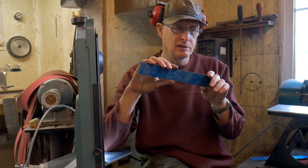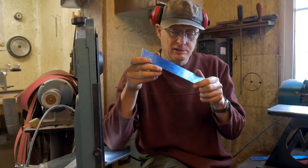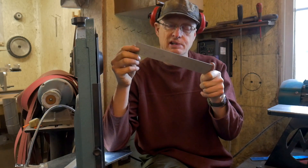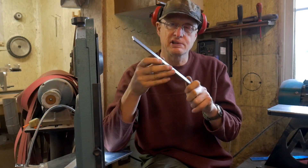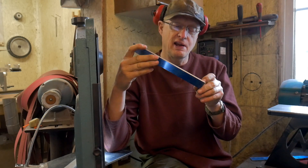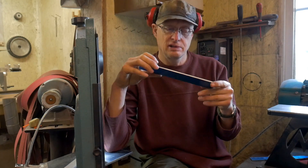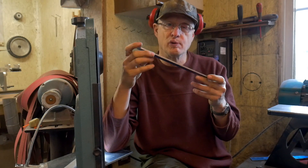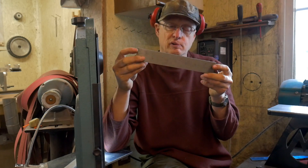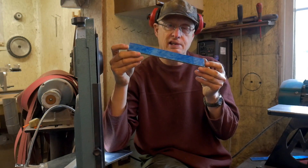For me it takes away something — not from the finished product, but the knowledge that I've actually had hands-on from the very get-go. Apart from actually having forged a piece of steel, this is ground flat stock, O1 carbon steel, and it comes fairly uniform. The process of building the knives is known as stock removal, where you are continually removing metal material from the billet to get to the final knife profile that you want.